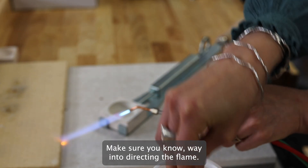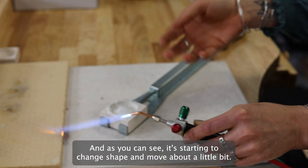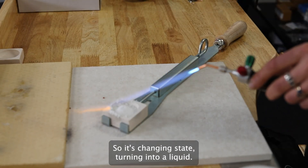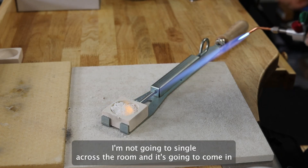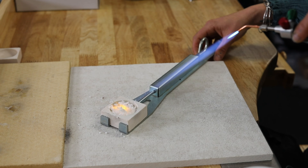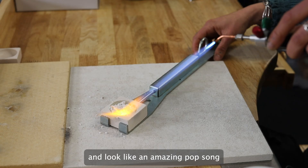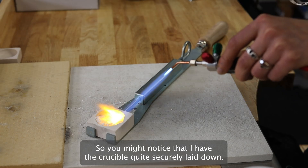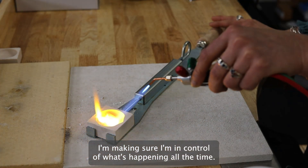Take the flame off for a moment, make sure you know where you're directing the flame, and let's just sprinkle in a little bit of that borax. As you can see it's starting to change shape and move about — it's changing state, turning into a liquid. I like to come in with my flame a little bit further away so that any loose bits aren't sent across the room. I'm going to come in slowly — it's going to carry on a bit and look like I'm making popcorn. You might notice I have the crucible laid flat with the handle not hanging over the edge of the bench; I'm making sure I'm in control of what's happening at all times.